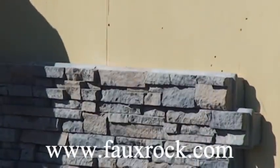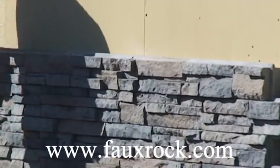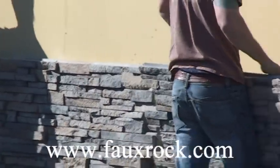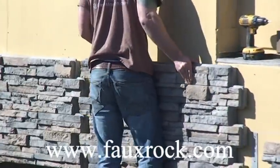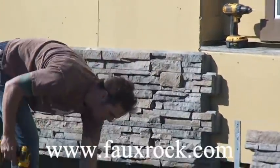This is a 12,000 PSI strong fiber-reinforced cement weighing in around 7 pounds per square foot. Cultured stone or real rock would exceed that — cultured stone is usually about 15 pounds per square foot. And we call it the lick-em stick-em: you put one on at a time with some thinset, you've got a scratch coat underneath, and we don't have any of that here.